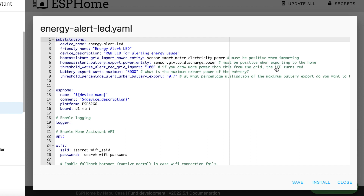I've tried to make this as easy as possible for you to adapt to your situation, but there are some prerequisites that you'll need sorting first. The sensor will need to know your grid import power and the power being discharged from your battery, and both of these must be positive values. So a grid sensor that's negative when importing is no good for this unless you make changes to my code. Once you have those entities in Home Assistant, type their entity names right here — this is the entity for grid import and this is the entity for battery export.